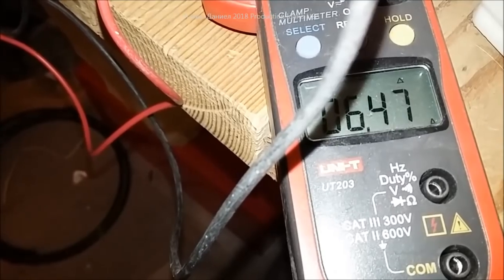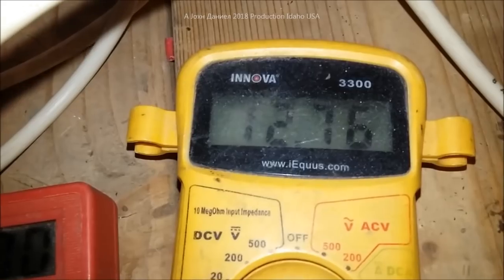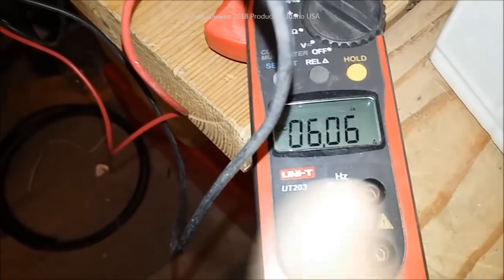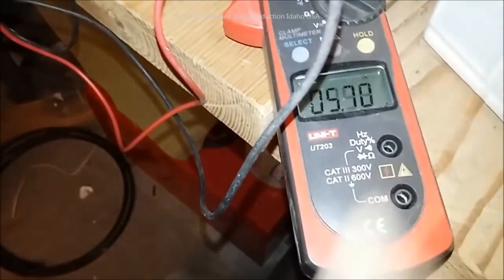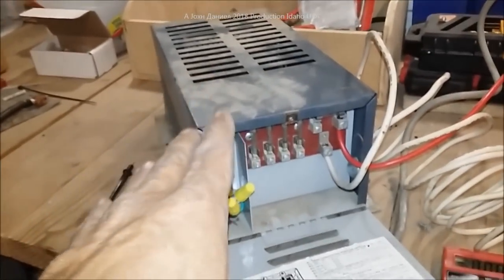The amps will slowly start going down as the battery starts to absorb more. The unit keeps answering with little spikes — you see those little spikes there. Right now we are at 12.68 to 12.7 volts and the battery is being brought back up. You see how it does that little jump back and forth — that's basically the unit checking with the battery constantly to see where it needs to be. It's an automatic charger with a sensor circuit that switches on and off. Now we're coming back up to 13.4 volts.